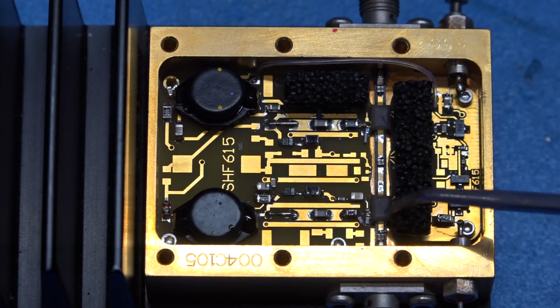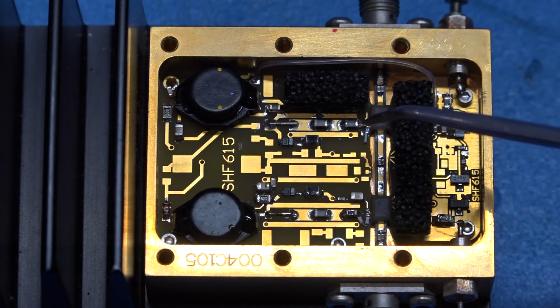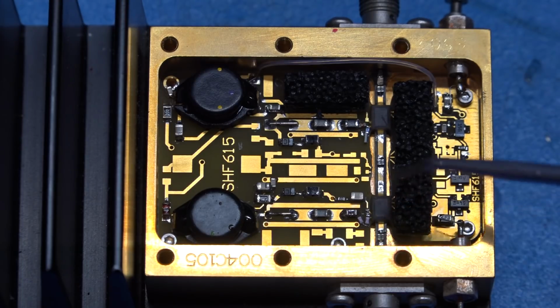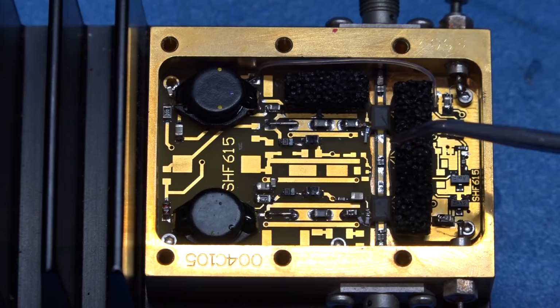And there are two MMICs. Now these are fully isolated from each other by these capacitors, but they're also fully covered. So I can't see anything on the die, so there's really no point looking at it under the microscope any more than this because you can't see it, which means that if those dies are bad, of course there's nothing you can do about it. Again, we're back into the same situation. But if this pin is broken, this may have just simply been the only issue here.